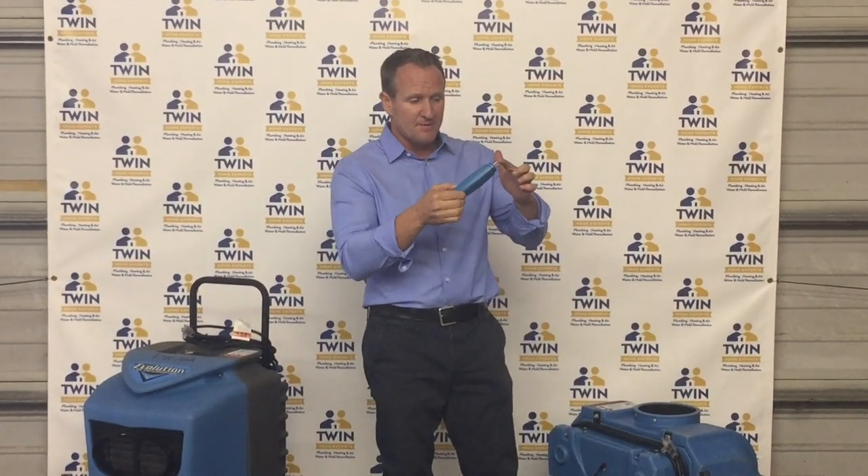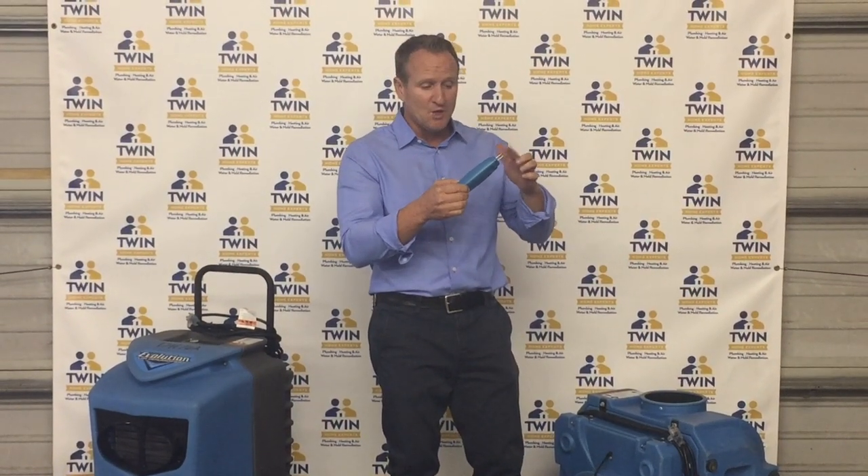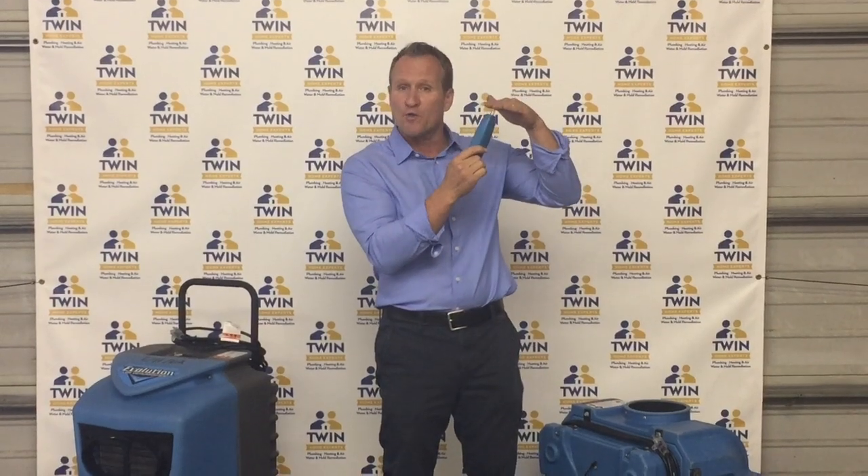After three days, you might want to get yourself a moisture meter — this is about $20. That beeping sound is an indication that there's still moisture. When you don't hear the beeping sound, obviously you're completely dry. It's a really good way to confirm 100% dryness: after three days, go in and poke the drywall or the wood — if you're not getting that beeping sound, that means you're 100% dry.